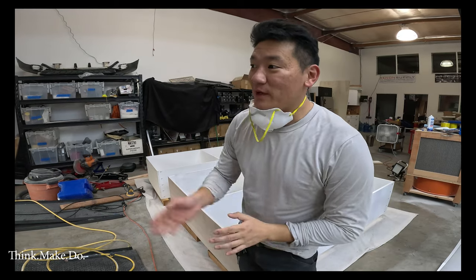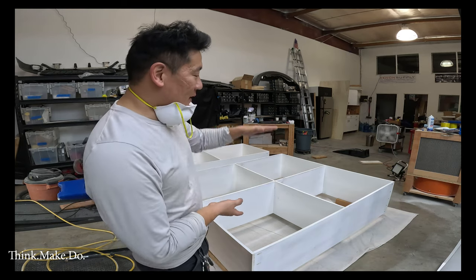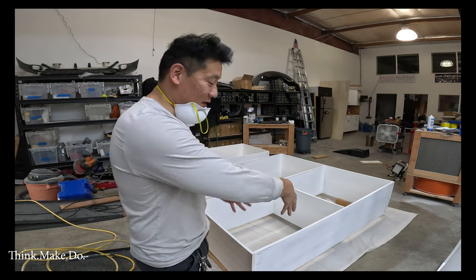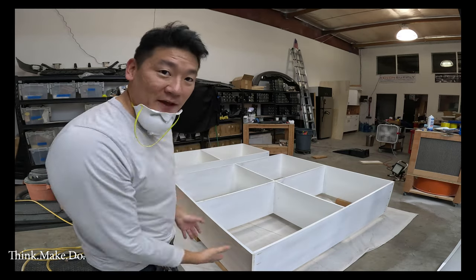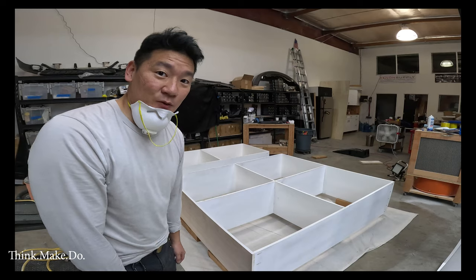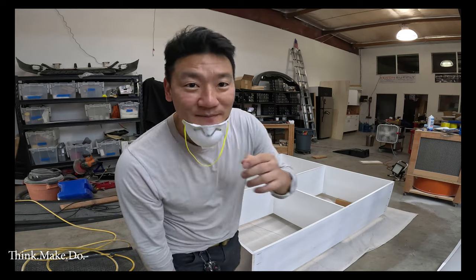Well, as you can see, because it's raining, we've brought all the cabinets back inside. And this time I am still going to paint inside, but I have all the cabinets facing down. That way all of my spray is directed towards the ground. I'm going to get a couple pieces of plywood sheet to build a little fence around the area that I'm working so the overspray doesn't hit the concrete too much. And we'll just keep on moving because work's gotta get done, whether you have the right space or not. All right, let's do it.